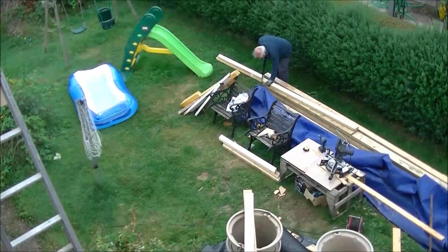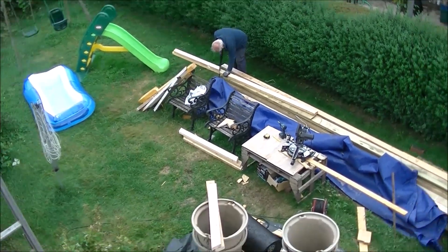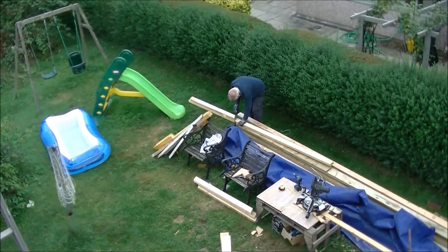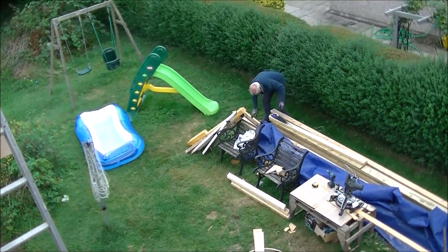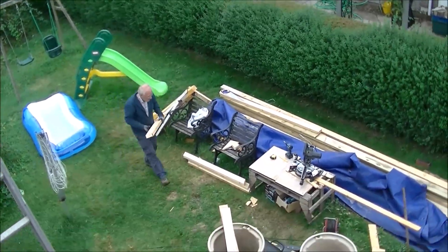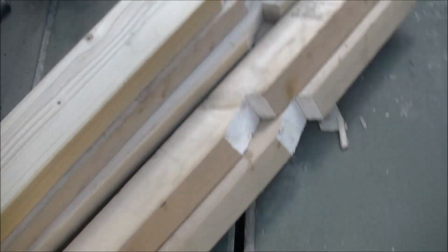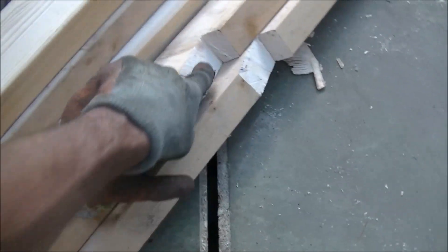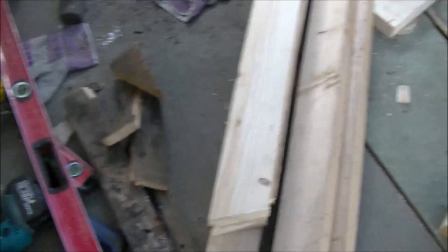Down in the garden, I've got Popper Pouse doing the bird's mouth cuts and cutting out the rafters. He's using a combination of the chop saw and a hand saw. You can see on the one that just dropped down the little bird's mouth there. So hopefully we're going to get about six — maybe eight — of these knocked up, all exactly the same. That's six pieces, all the same length. We're going to pop those up now and hopefully they should fit into place.